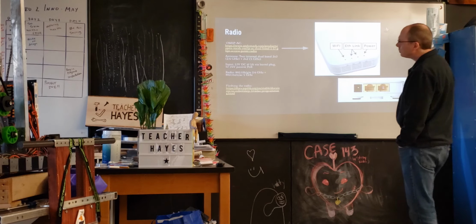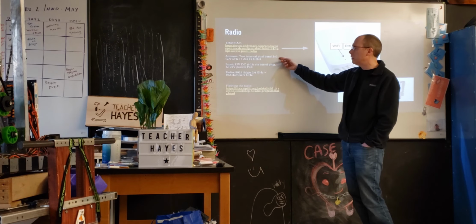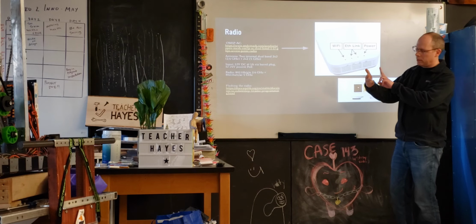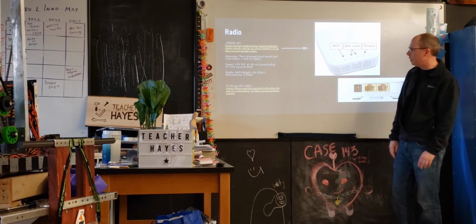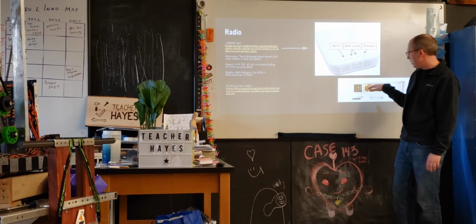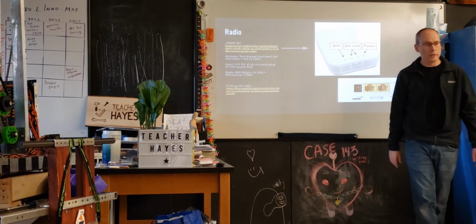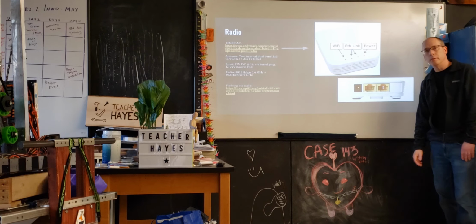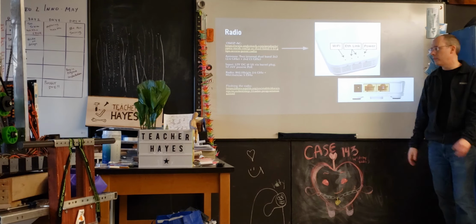So the other characteristics here, you'll hear people talk about, and this doesn't matter so much for FIRST per se, but this is actually what's called a MIMO antenna, which means that there's actually two sets of two antennas that are designed to be orthogonal to give you specialized coverage and better control over how you communicate with it. What's really relevant to us is you've got to get into the signal from this thing, right? The computer's talking to this. This is sending the signal back to the roboRIO and then back and forth. So it's a bidirectional signal going over 802.11. So it's very similar to all your PCs you're using here. There are newer, much newer 802.11 versions that will be like 6x6, 8x8, stuff like that, that can work even more effectively.